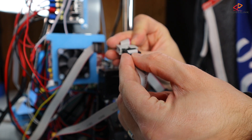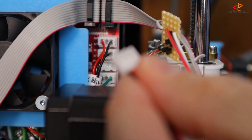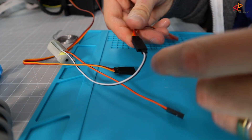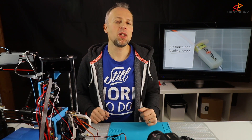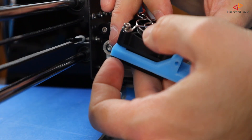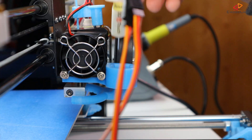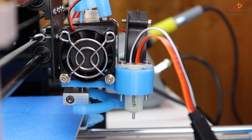Once having assembled our adapter, we can just plug the adapter cable in between the display cable and the main board, and connect our sensor extension cables to it. The next step is to mount the sensor to the print head, which is done using this holder part that I have printed out. The Thingiverse link is in the description down below. It's going to be mounted between the filament cooler fan and the extruder cooling block. Finally, fix the probe into the part using two screws, washers, and nuts, and we're done.